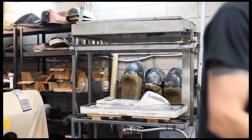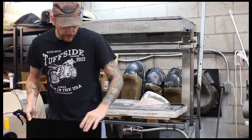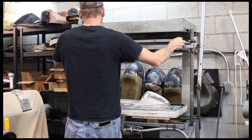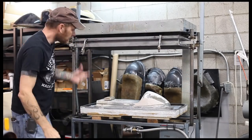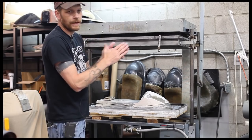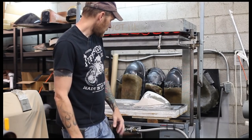Let's make it into a seat. Once we have the sheet cut we're going to clean it off, make sure there's nothing on it, load it into the machine — I've already put the mold on. This one we're doing a 23 inch cafe seat. Essentially it's a giant toaster heating up this huge black sheet of ABS that's 3/16 thick, so it takes a long time to warm this up enough to form it down over this mold.